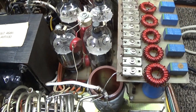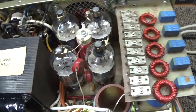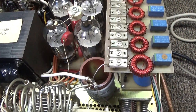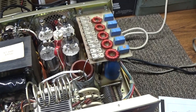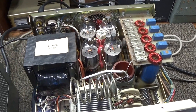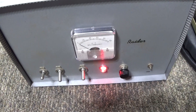It doesn't have a driver so you need a driver in front of it. Also, since it's a ham band amp, you need a foot switch or something to key the amp up - it does not key up on its own, there's no RF sensing circuit like a CB amp. This cable goes to my foot switch. It uses 6LQ6 tubes, same as in DNA amps like the Maverick 250 and the Phantom 500 - same type of sweep tubes, which aren't cheap.